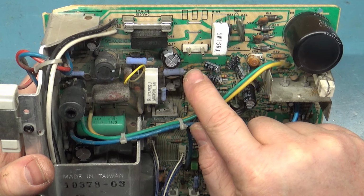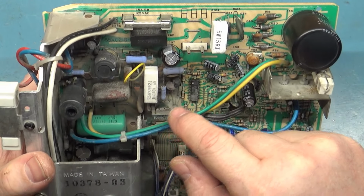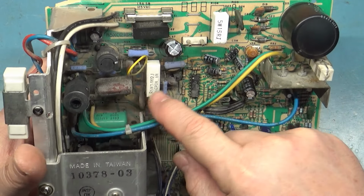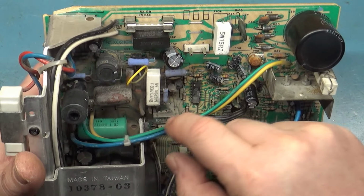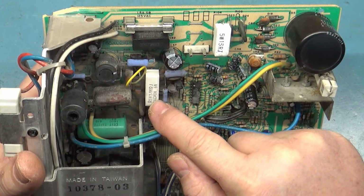R101's loose, so that's par for the course. The 19-inch doesn't use R96. A lot of them don't use R96, so it's missing, so no big deal there if you notice that. So R89 is completely loose. R101 is completely loose. R104 is also loose. And the missing brightness pot, the broken green drive pot, the rest of them survived intact.